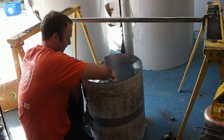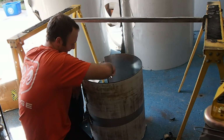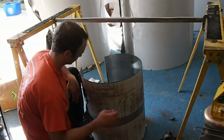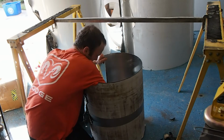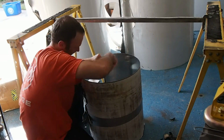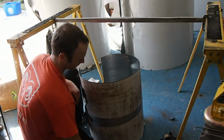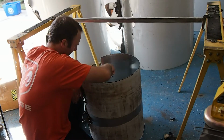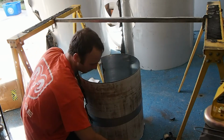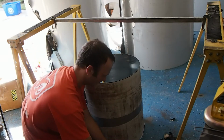You can see I just go up and down the back side of the panel so I get a nice coating of this. It's like a grayish, and then it'll dry to more of a white. You do want to lift the panel and get it all the way to the bottom so you really completely cover it. Same thing here, and don't worry if you get too much on. You'll get this off. You have to remove this. This is corrosive.